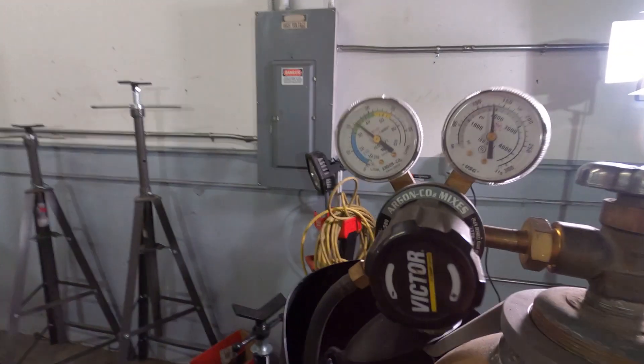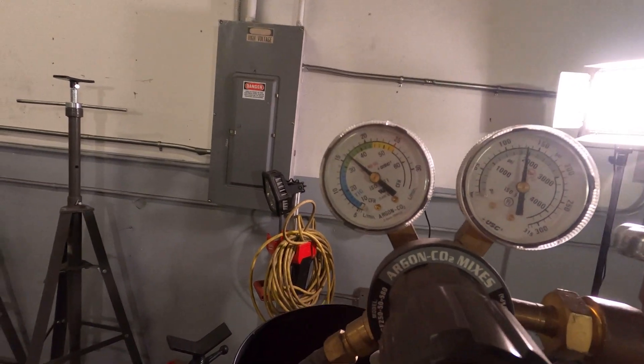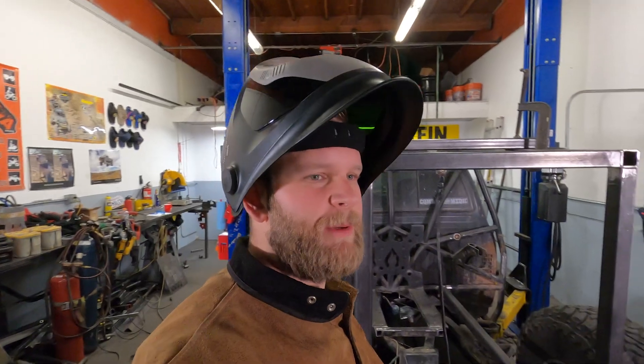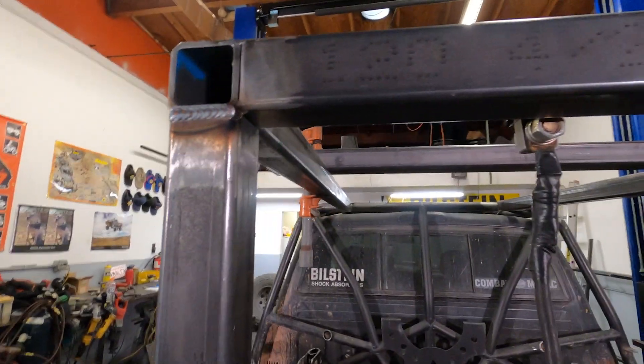Give it a dip in the old tip dip — you don't actually want that much. I'll check how much gas I'm using: 30 CFH is honestly pretty high for MIG inside a shop because there's no wind to blow away your shielding gas. I've seen people get away with running as low as 15; I think 25 is a good number for me inside. When I'm outside I'll sometimes crank it up to 40 just to get some gas coverage. I pretty much refuse to flux-core unless we're on the trail. This weld is actually a little better than that one — I want to grind these completely flat since they'll have flat panels on top, so a little hotter and flatter but still connecting both shapes. No inclusions — pretty normal.